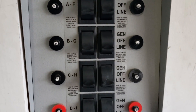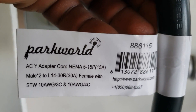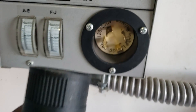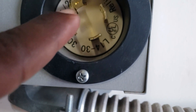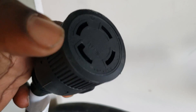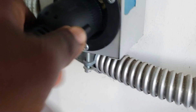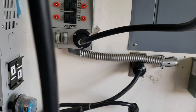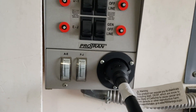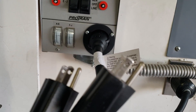So this is what I'm talking about — this is a 10-switch Reliance transfer switch. I would just come right here with my Park World Y adapter plug and just plug it right in. Find your key — you see this one right here on the top, you would get that one on the top, orient them the same, then twist lock. Then you'll be able to run this all the way outside. If this is close to your garage door, you can run this outside 13.5 feet into your generators.